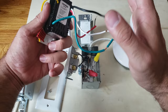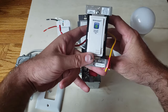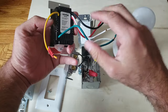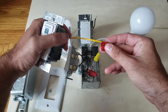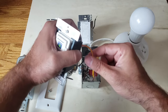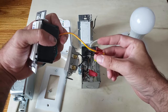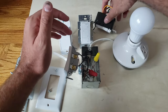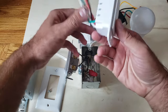We could use pretty much any smart light switch in our home. This is a Leviton dimmer switch — highly recommend these, they're nice switches and I've got a couple in my house. This last wire is for three-way dimming or three-way light switch applications — it's called a traveler wire. That's how you wire up a three-way smart switch, which will be covered in another video.